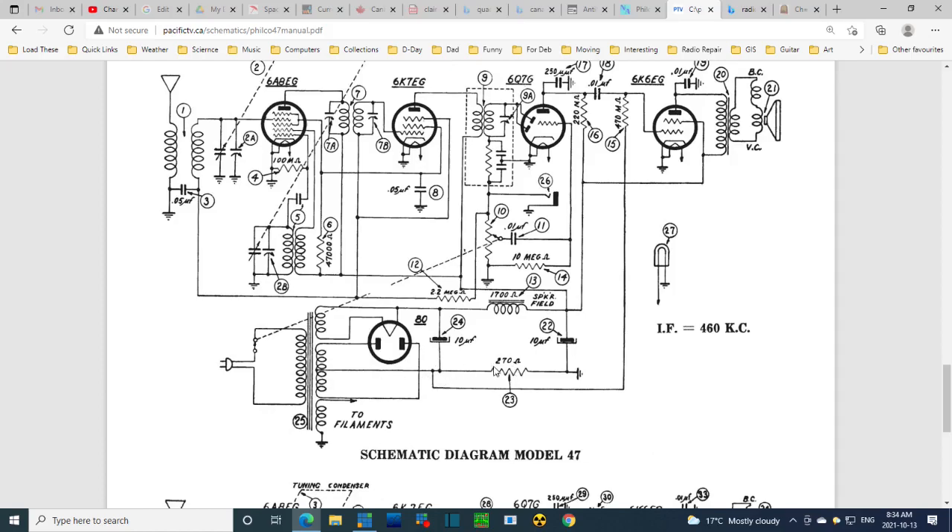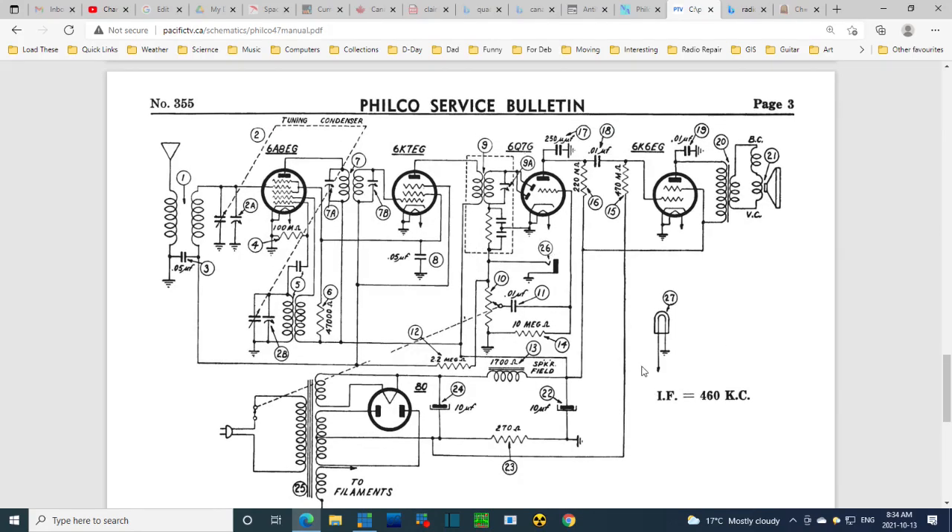Let's look at where this wire goes — it's the only wire leading here into the radio. It goes up to a very large resistor and onto the grid of the output tube. Very interesting. Out of the power supply, it looks like the whole thing is taken from the second side. We're powering up the plate of the output tube, powering up all the rest of the plates, these two through the IF coil, and then this one gets its voltage the same way.